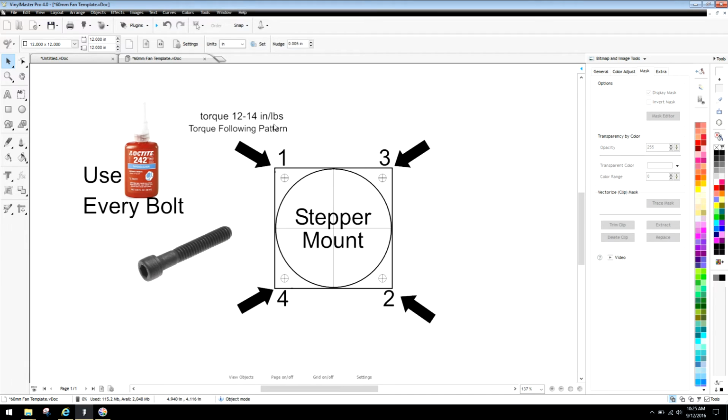As you're assembling it, you're using aluminum, so it's a softer substrate. It is metal, but it is softer. You're not looking at just ham-fisting things, so to speak, and tightening down things to where you're basically stripping threads or any of that. You don't want to get into over-threading anything, and this is a really nice torque rating. It's going to give you a firm pattern, and again, use your own judgment. If you feel 10 inch-pounds is sufficient, you can do that. As long as you're using Loctite and you've prepped the screws properly, cleaning the threads with acetone prior to assembly, you're going to be set.